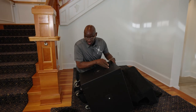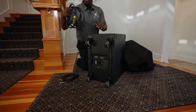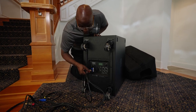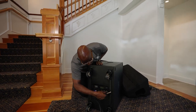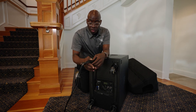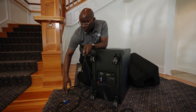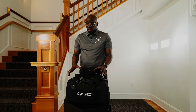On our QSC unit you will see the back — the power. Our blue cable is the QSC power and the XLR; we have them taped together. What you're going to have is what goes into the power unit: two XLRs that you put in accordingly into your line in. This power unit will go into your power strip, and these two units will come from your mixer into our power strip. Then we take this and go to our top QSC speaker, giving you full range from there.